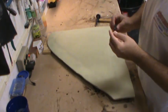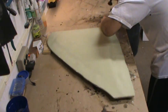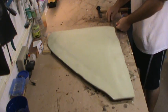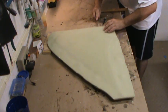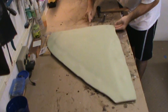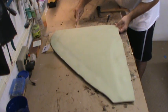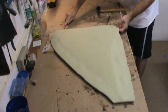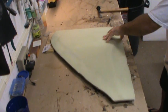To get started I'm just going to use a really small flathead that's fairly smooth at the end. The flanges on this one are a little bit bigger than the other one, but otherwise the molds are identical as far as how I went about making them. On this one the horizontal stab fit a little looser in the parting planes than the first one, so when I popped the first mold half off the parting planes the stab came out with it. I just cleaned the flanges on the first mold half, waxed it, PVA'd it, and laid up the other one — so the stab hasn't even been out of either half yet.